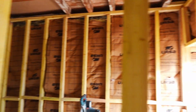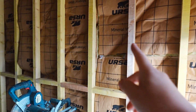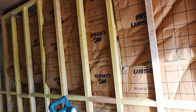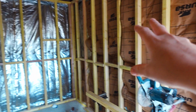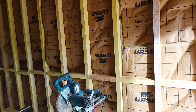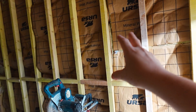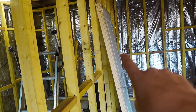What we're actually doing is double insulating on the exterior walls. This wall here is a gable end of the house, so we've got the foil insulation and I just had some fiberglass insulation already in stock, so I thought I might as well use it up — it's been sitting in the barn for about six months. We're using the fiberglass insulation on the external walls: this wall here, this wall here, and then the wall here with the window.